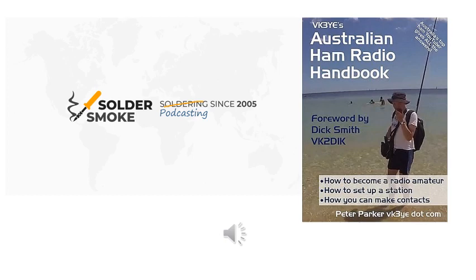Here in VK there's a radio company called Codan that makes a lot of outback communications gear — very robust, can be run over by a truck and still survive, designed for people with no experience in radio at all. They're used for the flying doctor and school of the air. It was an SSB rig — solid-state ones built from the late 60s and early 70s — with instructions in the lid of the case. There were instructions like 'run 30 feet of wire from the antenna connection and tune for maximum brightness on the light bulb.' I actually used a light bulb in series with the antenna instead of an SWR meter for quite a long time, and I still go on the basis of field strength rather than SWR.